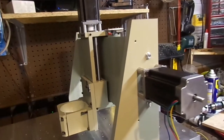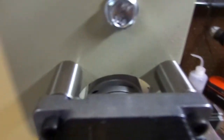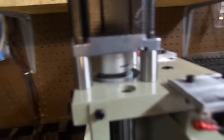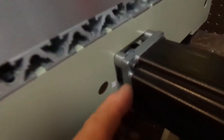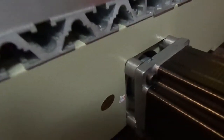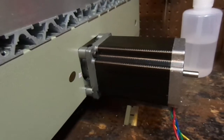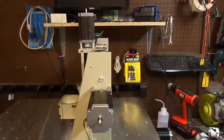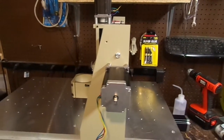I've got all the stepper motors mocked up — here's a quick view of everything. There's the clearance inside the coupler, and the stainless steel spacers. There's the Z-axis — you can see plenty of clearance around the coupler. Here are the machined spacers to fit the pocket. I had to cut 200 thou off the spacers. That completes the modification of the frame to mount the steppers. This completes video number 3 of the CNC upgrade for the 6040.